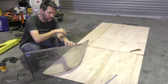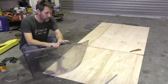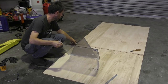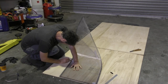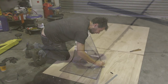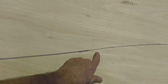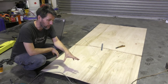My plan is just to put it up against one edge here, and then literally just roll the curve over this, marking it as I go. A bit of cardboard would be perfect for this, but I didn't have a piece large enough, so I'm just using a bit of thin bracing ply. I'm going to start square against this edge so it's one cut I don't have to do. You can see here I've got a couple of double lines, and that's because this is the piece that was offset by a mil or two, so I've actually corrected that. I'm going to cut inside line here and outside line here - I think it'll give us a more accurate template. Now I'm just going to cut this template out, take it down to the perspex store, get them to cut a piece, and then we'll come back and start looking at how to bend it.